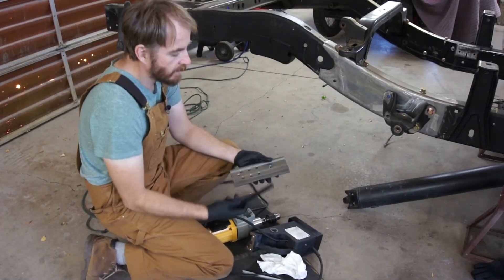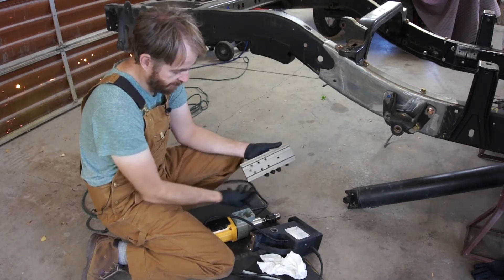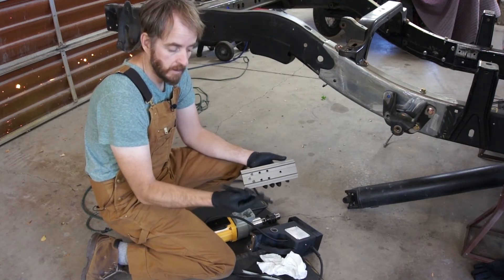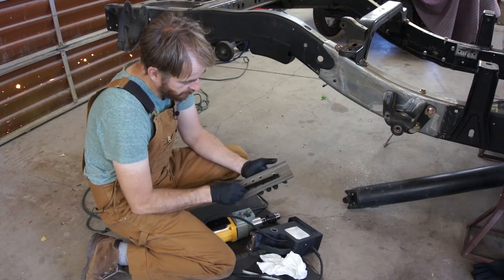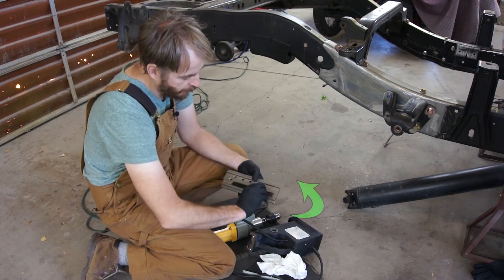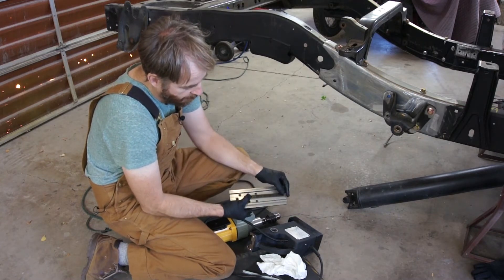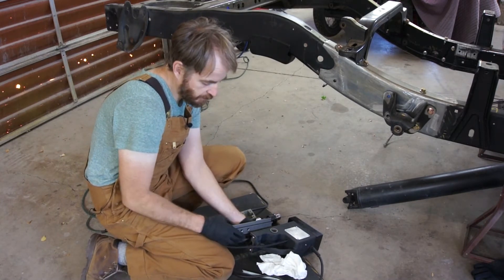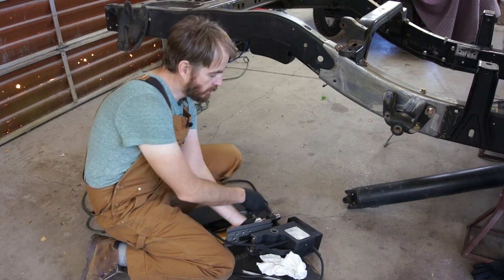So here's how I'm going to modify this to make this work. With the drill bolted here, I think we're alright — we can get enough height. But we run out of room on the rack. So what I'm going to do: it was originally installed kind of like so, where this acts as a stop on the base. I'm going to flip it over and drill new holes so that it sits flush like so. That will move the stop to that point, which will allow it to rise up to about there, which should give me enough room — barely — to run a standard drill.